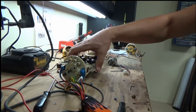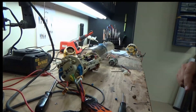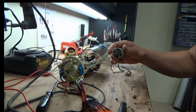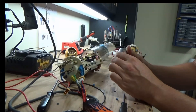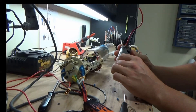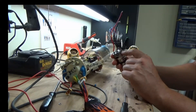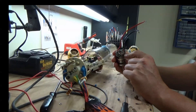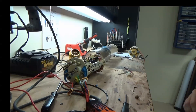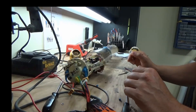The refurbishment of this cylinder entailed a few different things, not the least of which was replacing the motor itself, which for whatever reason had its shaft spin loose and I was not able to repair it. You can see a lot of corrosion — that speed controller was venting gas and hot plasma right onto the motor, so unfortunately this one is shot. Brand new motor in there now.